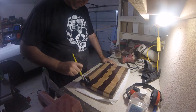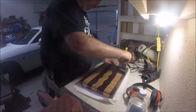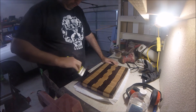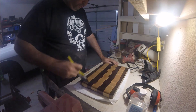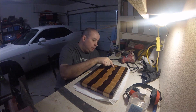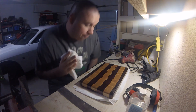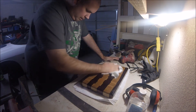Because this is end grain, it will soak into the fibers of the wood, just like water moves up in the wood when it's on the tree. So I put a healthy amount of oil all over the whole thing and just let it soak in. Then I'll come back in half an hour to 45 minutes to see if it's all soaked in. It's been about 45 minutes — I went inside, took a shower, shaved, came back out. I can see it's absorbed in most areas, with just a few places where it hasn't completely absorbed. I'd say that's pretty good for now. So I'm going to wipe off the remaining oil, and I think we're pretty good to go.